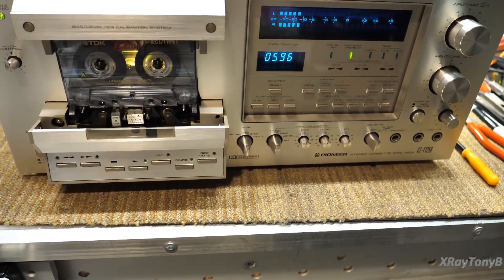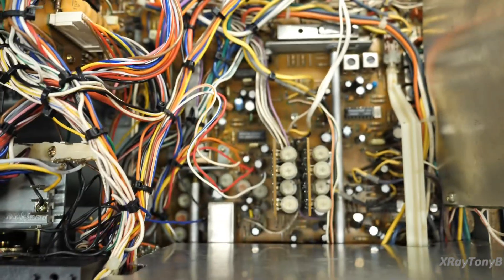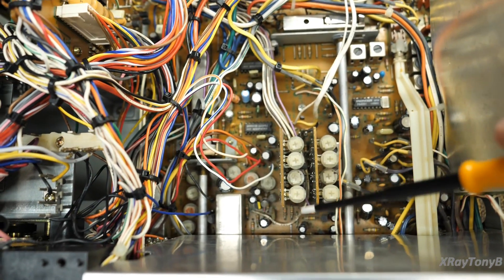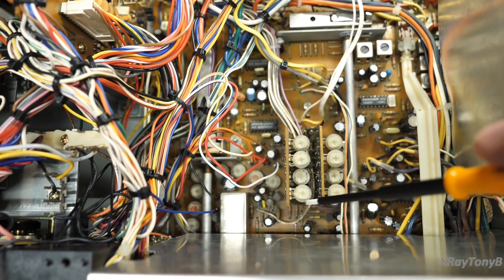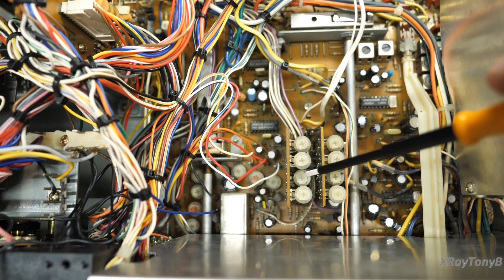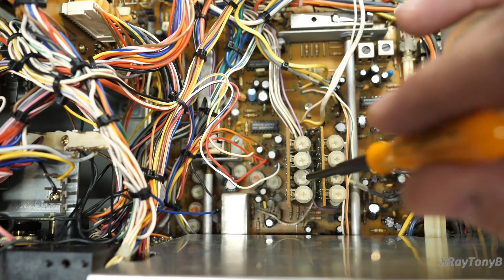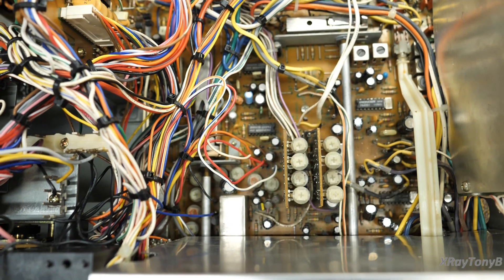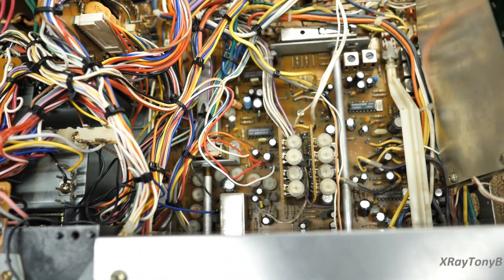The first thing they have you do is look at this little standoff circuit board right here — these two circuit boards. There are four pots. Each one represents left channel and right channel for metal, standard, chrome, and ferrochrome tapes. What they want you to do for each of these is take these pots and adjust them to their center point. That's going to throw off all your levels, but we don't care about that right now — they just want this at the center point of the record level adjustment.